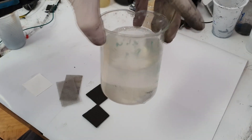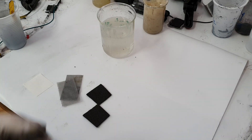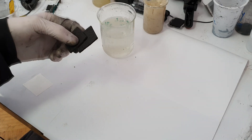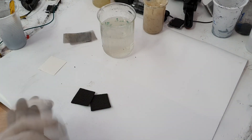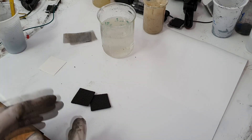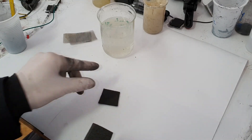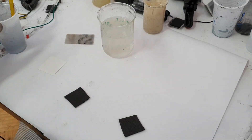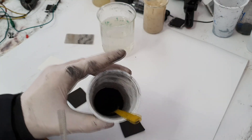Here is the salt water and now the electrodes. For the current collector I use stainless steel. For the active surface I use graphite carbon foam. The separator is made from filter paper and this time I will also use some activated carbon. So I will add activated carbon on the surface of each graphite carbon foam. But if you don't have this graphite carbon foam you can also use only a mix of activated carbon and graphite together.